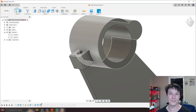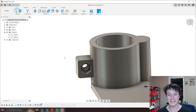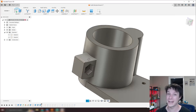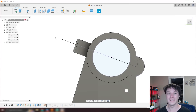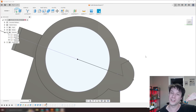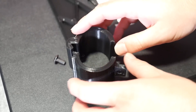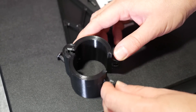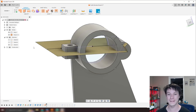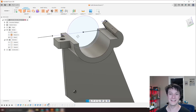We have a tab with a screw and nut that will hold things together. There's a hole for the screw, and at the bottom a cutout for the nut with 0.2mm clearance to make it snug but not too hard to insert. I then created a sketch to cut the part into two. One side has a clean cut for the bolt tab; the other side has a detail — you insert the top part into that little divot, screw it into place, and it can't come free because it can't lift out once assembled. We turn this into an extruded surface and use a split body operation to cut the part into two separate halves.